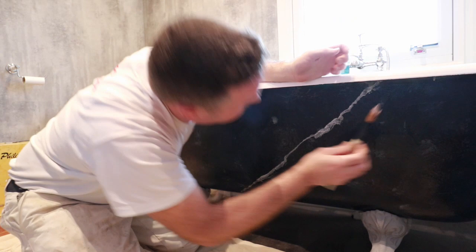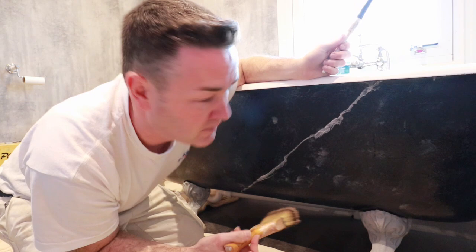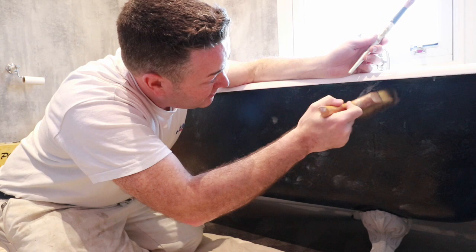That's it. Now again, tips of the bristles, the badger softener. Badger softener, guess what animal that comes from? Soften it with the direction of the grain, and then across it. So literally just softening out that brush mark.